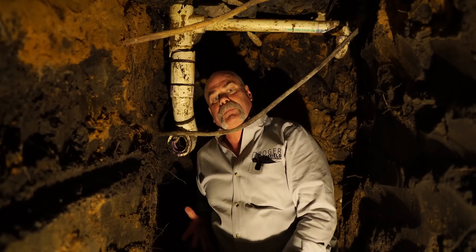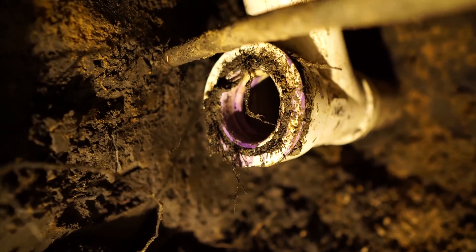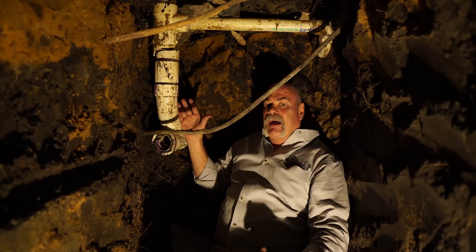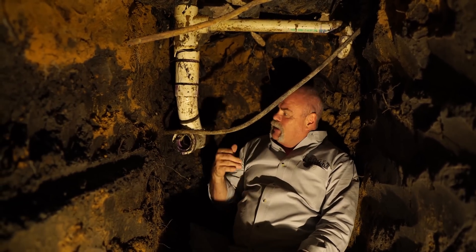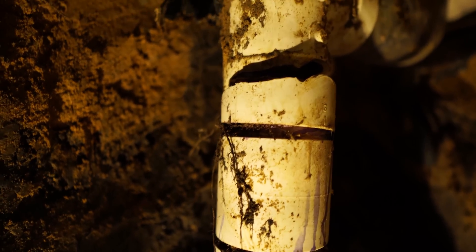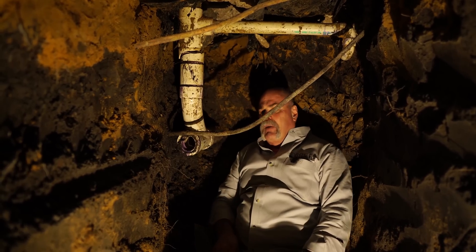Up under the house we've got water lines and a line going over to a bathtub. Here's my problem — we've got a break here, and the reason is this was not put in in a smooth situation. All of this was in a bind; you can tell because it's pushed off center and pushed back this way. My thought is that when this pipe was put in, either there wasn't a good bedding so the pipe sat right, or they left voids, and when you backfilled it pushed the pipe around.